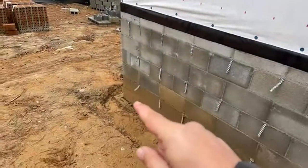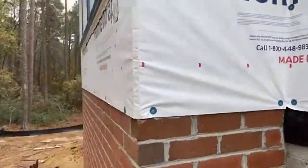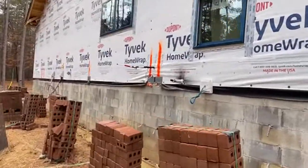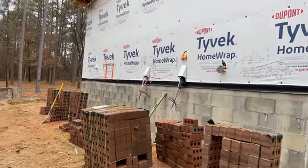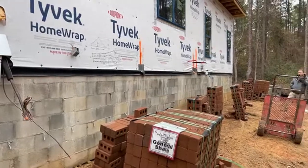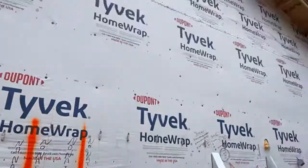In some cases, wall heights change — 13 feet 9 here, 14 feet 9 over there — because of the difference in elevation where the brick starts on the veneer. It's simple: we go around, do the math, figure it up, write the number of cubes per wall, then add up the total and compare it to what's on site. If we're way off, we order more. If we're close, we keep a watchful eye as the masons progress, and maybe a week ahead of the end, call ahead to order if we need, say, another three cubes to finish out the job.